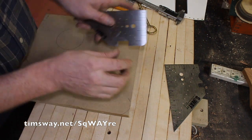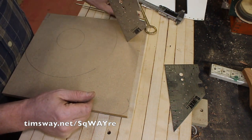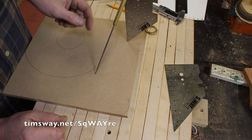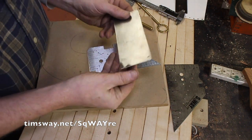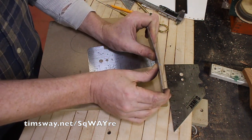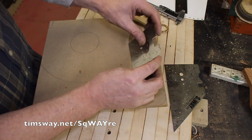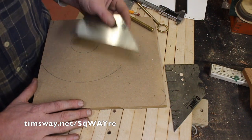You can actually use this as a saw if you want to get something started. This tip can be used as an awl. It also works as a card scraper. This is a card scraper — it's made of tool steel so it has a little bit of flex, and a lot of times when you're scraping you'll flex it. You cannot flex the square because it is made of stainless steel, not tool steel, and it will kink. But it comes in handy for scraping down the MDF waste board of my CNC machine — you get those screw holes — and you can actually scrape with it for real.